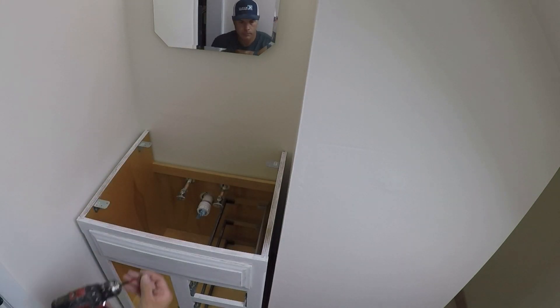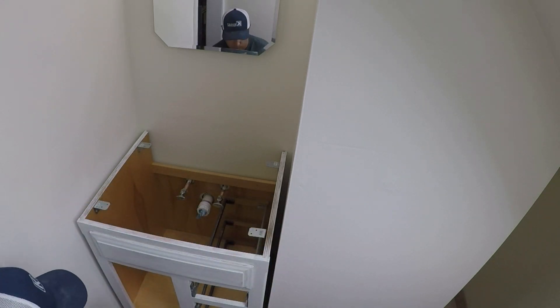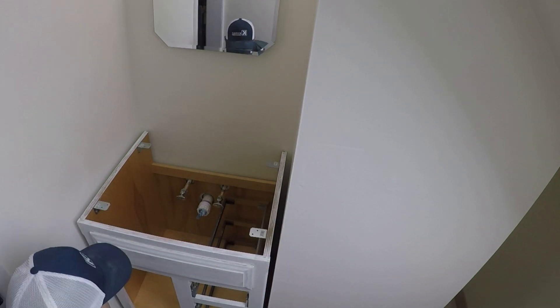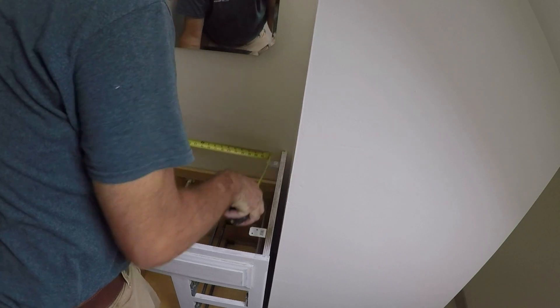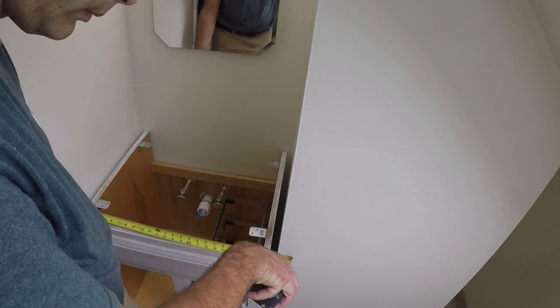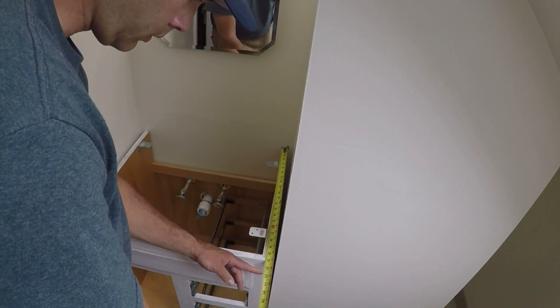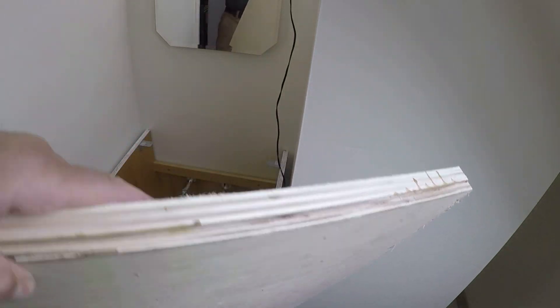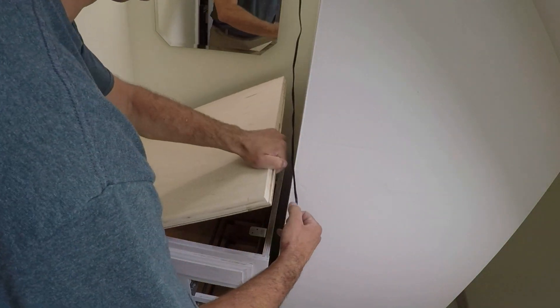This is a little bit unique because I'm using a piece of plywood for my backing and then the tile will go on top of this. With all four brackets in place, I measure for my plywood. I have a piece rough cut to the overall width and about 22 and a half inches deep for a typical countertop. I check the squareness of that opening and cut the plywood. It's a piece of half-inch plywood and three-quarter-inch plywood glued and stapled together — an inch and a quarter total thickness — because I wanted something substantial to mount my sink to so it doesn't bow or flex over time.